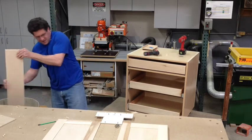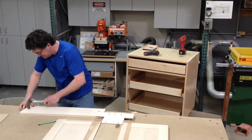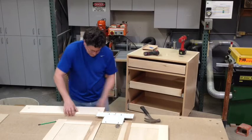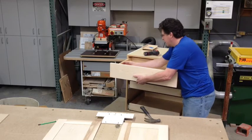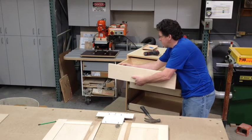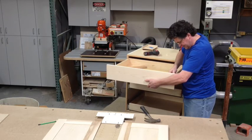Modification will be a drill press for this, but for right now this is going to be fine. I got a garbage can right here to get most of it. You just hammer in the drawer front adjusters. Hammer in the other drawer front adjuster. And then inside you just use a machine screw. Mount the drawer front. Part of doing the job is putting the drawer fronts on. At least with this it gives you a little more adjustment.